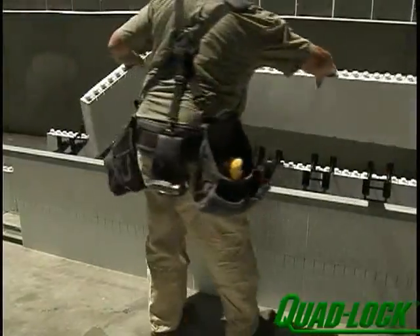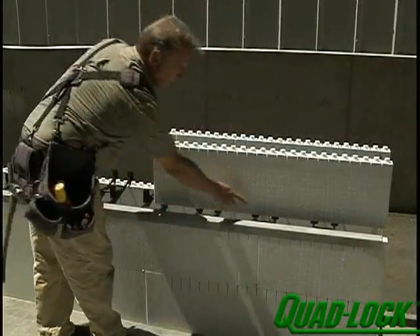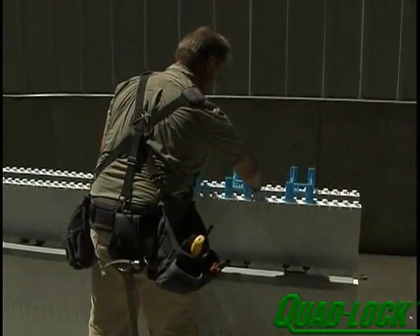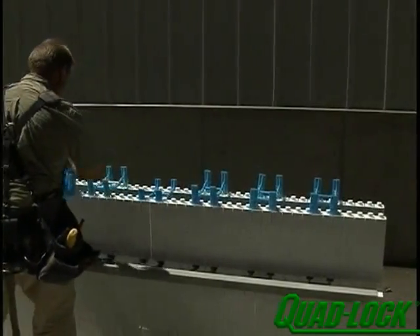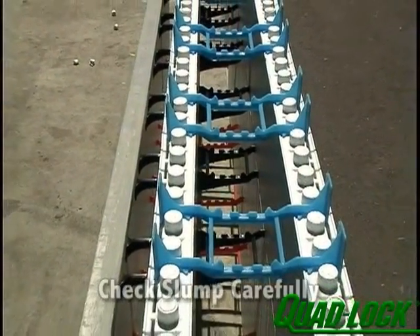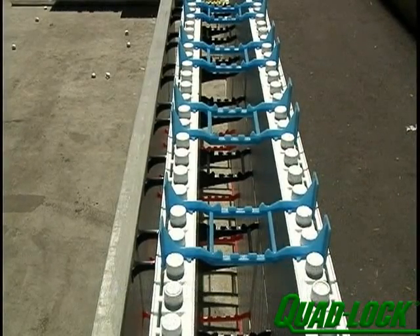Place panels on the upper flanges of the brick ledge ties to form a 6-inch cavity wall and continue to the desired height. When pouring a brick ledge built in this fashion, pour concrete 4–6 inches higher than the level of the ledge and make sure concrete is consolidated to the outside of the ledge. Strike off excess concrete from the top of the ledge and wait a few minutes until the first lift begins to set. Pouring concrete at too high a slump will result in spillage, so check slump carefully and allow for set time.